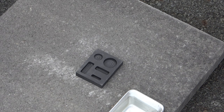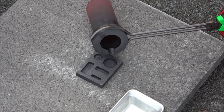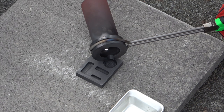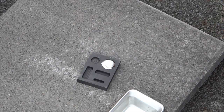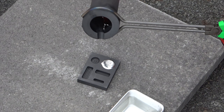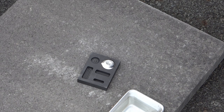Getting a better grip on this - there we go. It was very dry. I didn't quite come up to temperature - that little bit cooled off too fast. I jumped the gun; it was only at 1086. I should have waited until 1150, but we'll see how that one works out.